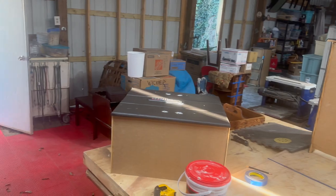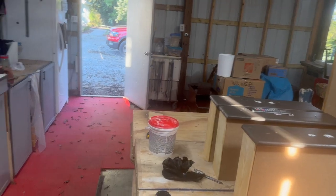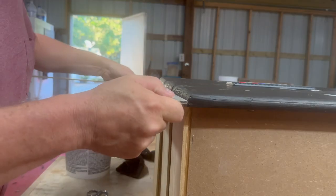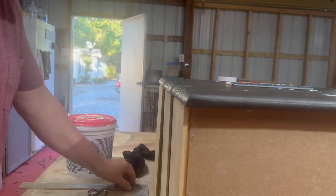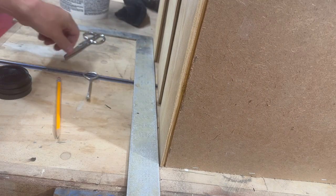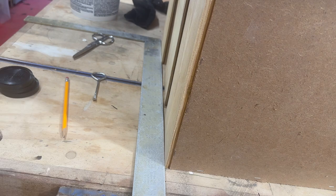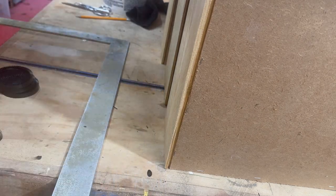I am not liking, they don't look spaced evenly. Yeah, so that's the problem. If we look at these, they are perfectly flush. And if we look at this, look at the gap. I can put that whole lip down in there, and that's a quarter inch or more. Remember how hard those drawers were to pull out, one of them? That's why one of these drawers is not square. So those two look pretty good there.